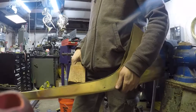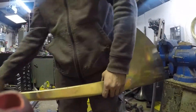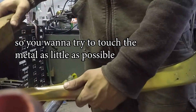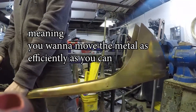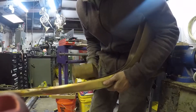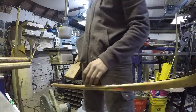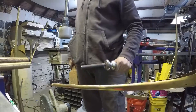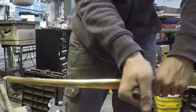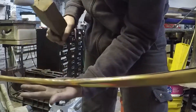Just because it's way easier than trying to sit here tapping this thin-ass sheet. If this were 020 then I could do it no big deal, but this 016 has a minor problem. So I'm gonna take this little paddle and I'm just gonna make a little steeple. You want to try to touch the metal as little as possible, meaning you want to move the metal as efficiently as you can with little hits. And we're gonna do the same on the other side. So I just want to kind of peak the two edges together. You can use a roller - I got my little roller here - you can roll the steeple down. It works better in trumpet patterns, it just doesn't always work perfectly. Your steeple has to be really tight on a horn pattern for that to work. And then what I do is I lift it off the mandrel and then I just hit some light little taps to bring the edges together.